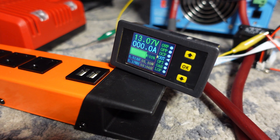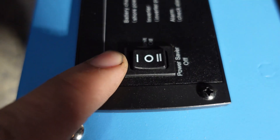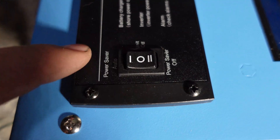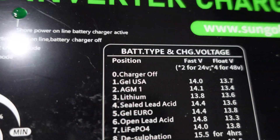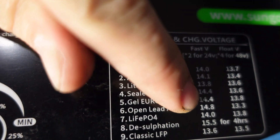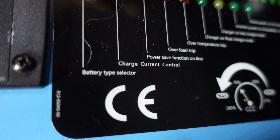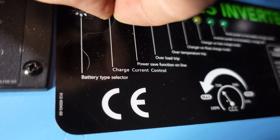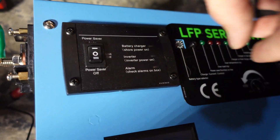There are two modes on the inverter: power saver auto and power saver off. When you click power saver on, the inverter is essentially on standby — once current consumption begins to rise on the output side the inverter powers all the way on. On the top you have your battery type selector — I have it on number 7 for lithium iron phosphate, which tells you the charging voltages. The dial adjusts the charge current; past a certain point it enters constant-current mode. I normally turn it all the way down and ramp it up as needed — 30 to 50 amps will suffice for me.